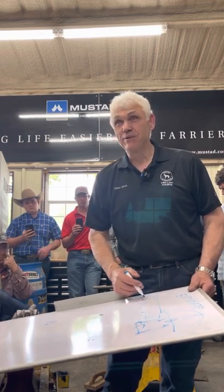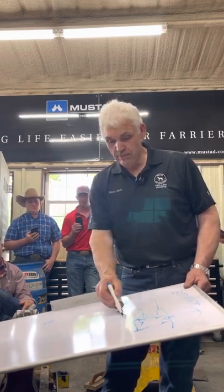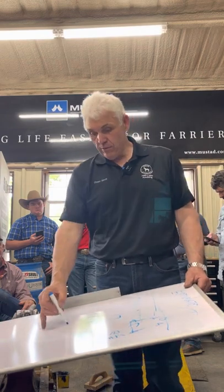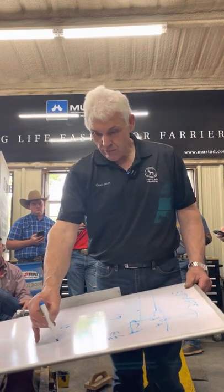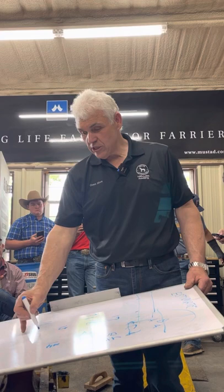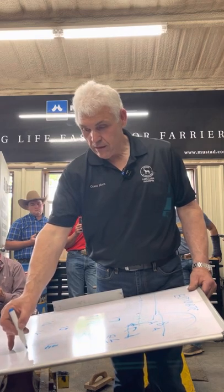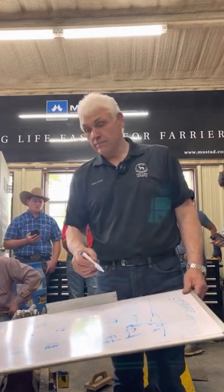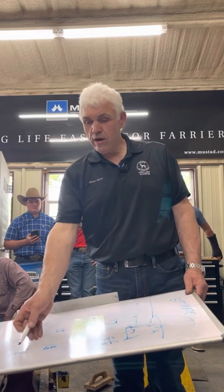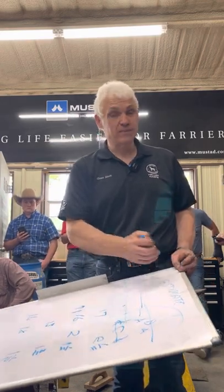So that's easy, but what about 14 inches or 15 inches? Drop down a 1/4, drop down a 1/4. So 17 would be 2 1/4. 15 would be 1 3/4. 14 inches would be 1.5. What did I ask them to cut? 14 and a half. So 1.5, 1 3/4, what's in the middle? 1 5/8. So right now I've got to mark this at 1 5/8.